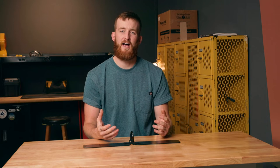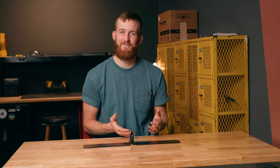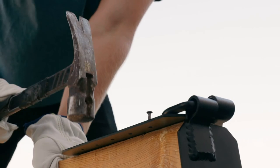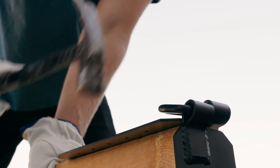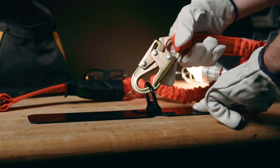Multi-use means you can install it on your job, use it for the duration, and when it's completed, uninstall it and take it with you to the next one. The installation is simple: find yourself a support beam or a rafter, pull up a couple shingles, nail this in place, and you've got yourself an anchor. Then attach your tether to the set anchor point.